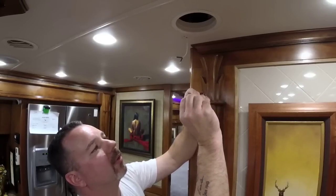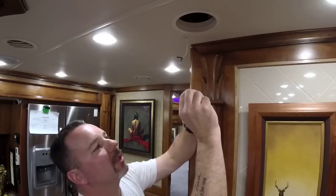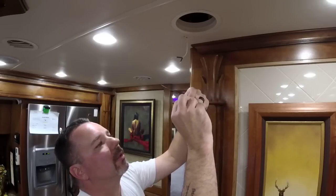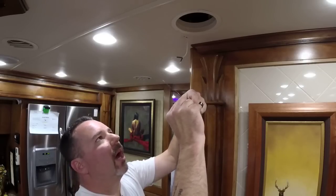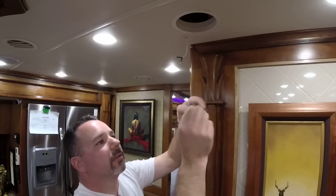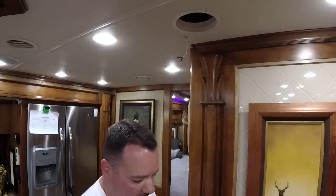You don't want to bend it right at the glass of the thermistor because you can break the glass. But you want to have a nice bend because that will be sticking out of your ceiling. Will be, but you'll be very hard pressed to see it, because you'll have it on the other side of it. Yep. And then I'm going to pre-tin these here.